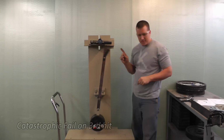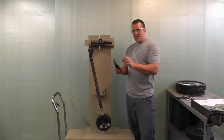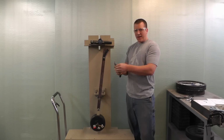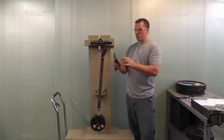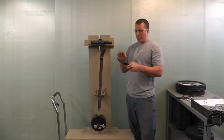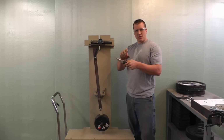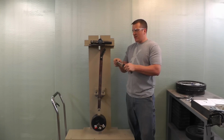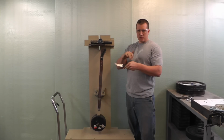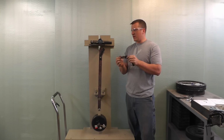And I did mean to say, let's leave that there. I do feel the slightest bit of play up and down. Not even up and down, just its movement. I don't think it's even up and down play. I think it's the play of the pivot into the hole, the half a thou, you know, that's clearance needed can be felt. That's nothing against this axis lock. That's just with the way that lock's configured. You might get that. I don't think that's a bad thing.